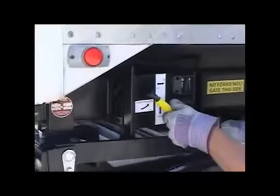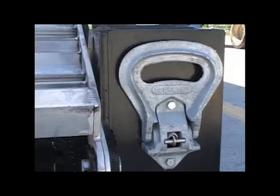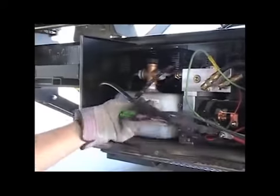Check the transit safety hook and ensure it functions correctly. Check that the tandem slider stops are in place. Check the footstep and ensure that it is in the up position during transport. Locate the pump box — it is located directly behind the trailer tandems mounted to the liftgate. Within the pump box, check the fluid level, make sure the green charge light is lit, and check the electrical wires to ensure connections are tight and grounded to the trailer.